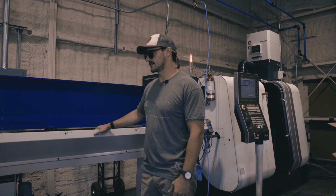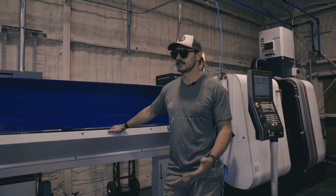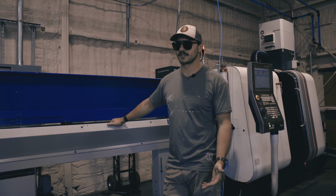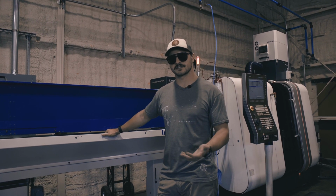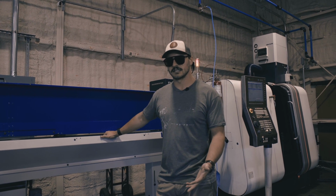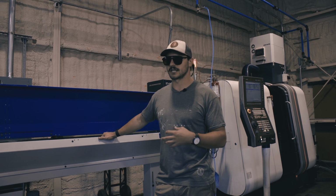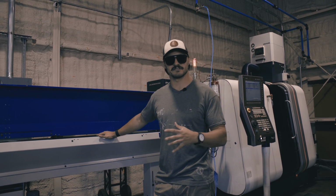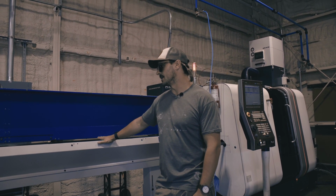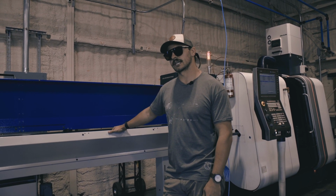What makes this a lot fancier is that on a Swiss machine, generally speaking, the spindle is a lot faster. The bar feeders that we have on our CL1 and our ST20Y limit the speed that we can turn our material at because it'll cause too much vibration, because everything's not quite perfect enough. On this machine, everything is about as perfect as we know how to get it.